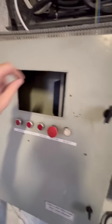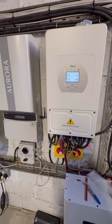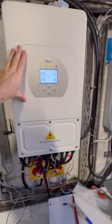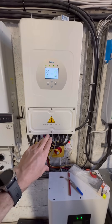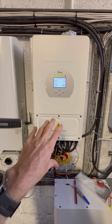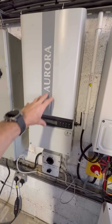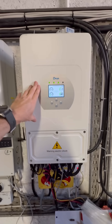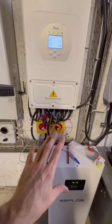I'll be sticking a nice new PLC in there as well. Coming back to this, I have most of this already up and running and tested. When I'm in off-grid mode, the wind turbine now works beautifully with the solar panels. When you go off-grid, you change over the generator switch in the house, and the UPS feed from the bay system sets up a 230 volt microgrid. That allows the Aurora inverter from the wind system to synchronize to it. The wind system can then charge the batteries, and the bay system can take from the solar panels, the wind, or the batteries. So that all works very well.